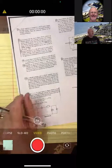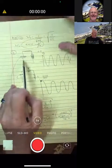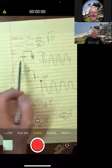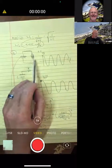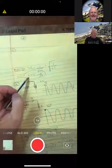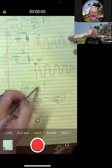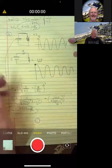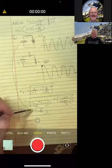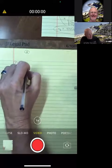Not too much. In fact, a lot of times when you're just roughly doing these things, you literally hook up a capacitor and inductor and go, well, you know what? There is some resistance because of the twisting, but you can just skip over this dampening frequency and then just do the LC without any dampening. And you know that it's going to be a hair less than that. But if the resistance isn't much, it's only a hair less. And so you can see we're down a little bit. In fact, that's how I'll do a percentage. So let's look at the change in the frequency compared to the original frequency.